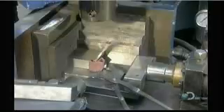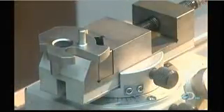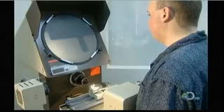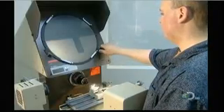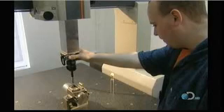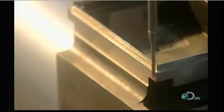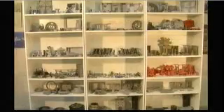The final step is to make sure the part came to the exact dimension specified in the technical drawing. This is called sizing. Steel parts have to be heated up in an oven for sizing; aluminum parts are sized cold. Technicians use a series of tools and presses to measure the part. If it doesn't meet specifications, it's either reworked or simply discarded. Sophisticated equipment such as an optical comparator is used to check angles and radii, and a coordinate measuring machine verifies dimensions. Lost wax process casting is used to make metal parts for all types of machines and equipment, everything from military weapons to snowmobiles.